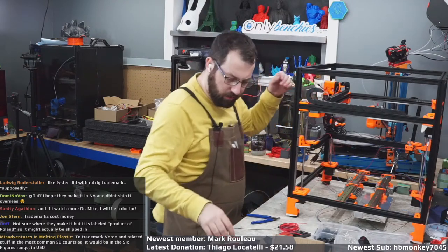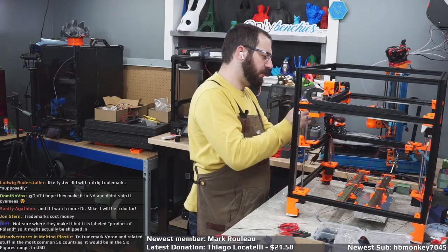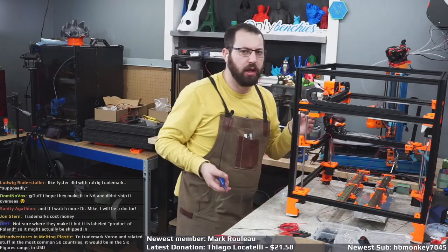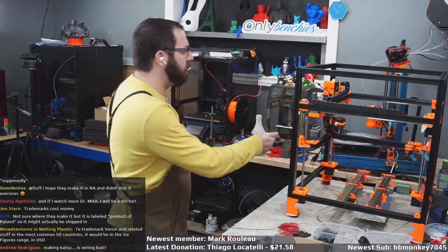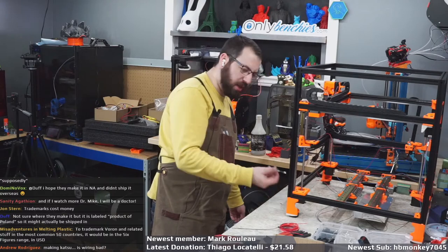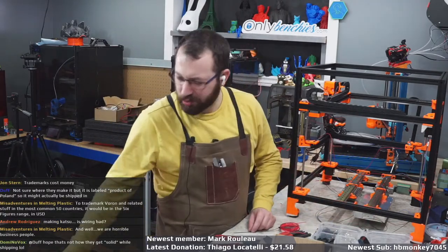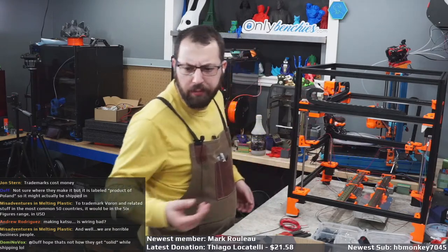Is that one. Now, some people like to bundle up their connectors, so instead of two 2-pin connectors, run a 4-pin connector for the fans, so like double them up. Same with your heater and your thermistor cartridge, same thing, double them up. Personal preference. I don't do that too often, but if that is something you want to do, that is something you can do.